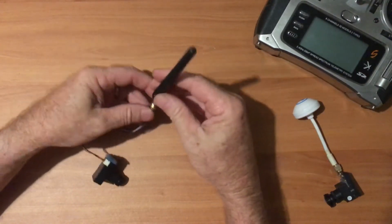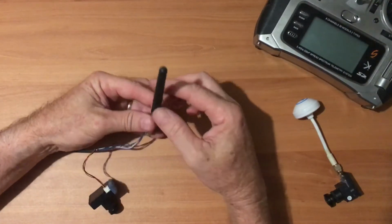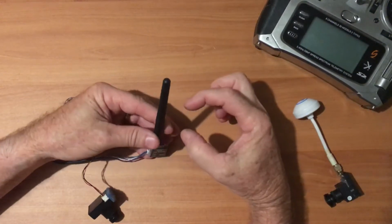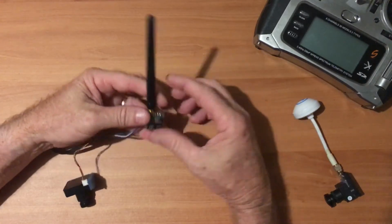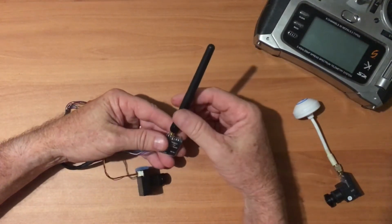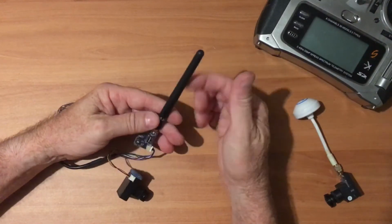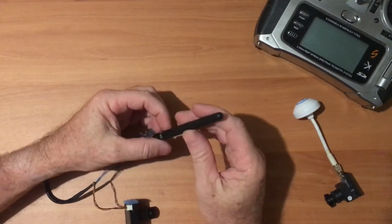But on my aircraft, it's constantly banking. Most gain is out the side, like I said, but as the aircraft banks, it might start pointing towards my ground station, and my gain is reduced. My video quality might be reduced, or signal reduced. With these omnidirectionals, they're cheap. They're also called rubber duckies, by the way. Rubber ducky antennas, omnidirectional.